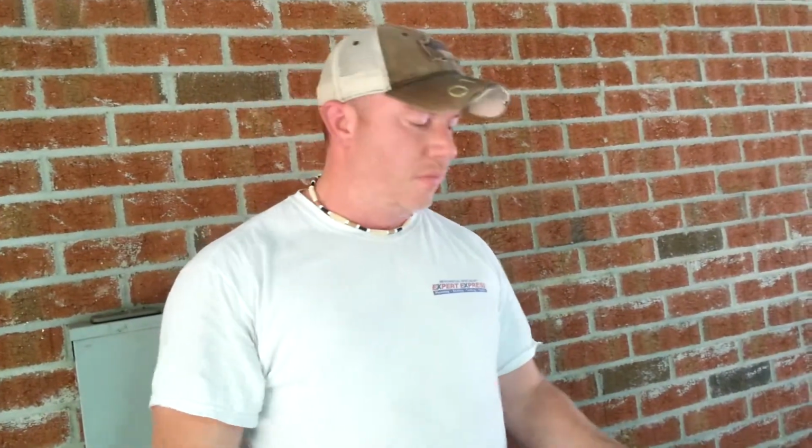But I always like to verify, because I've gotten plenty of homes where they use a system that was designed for a TXV, but nobody installed the TXV. Some installers don't understand TXVs, and so they've never installed it. So it's always important to take a look at the coil.